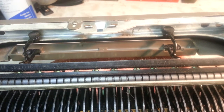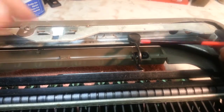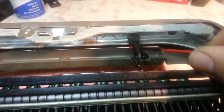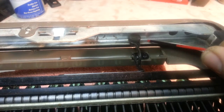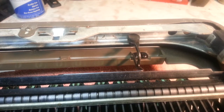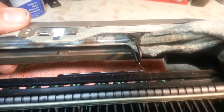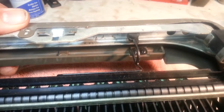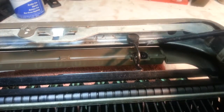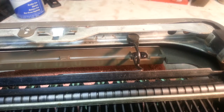Pointing the tool here — we got a stop on this side. When you press the spacebar it bottoms out here, and when it comes back it touches on the backside here, that piece of metal, and it gets sticky right there — makes contact on both sides. One thing you can do is get in here and clean it off with whatever chemicals you've got, and it'll work, but I've had those re-stick even after cleaning.